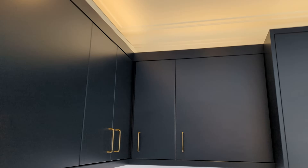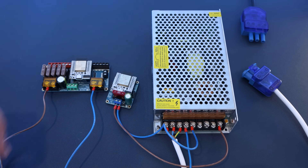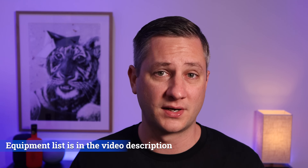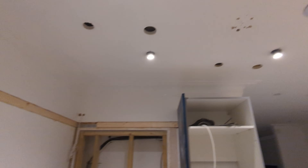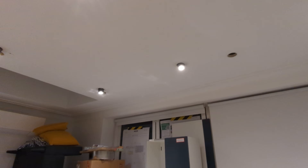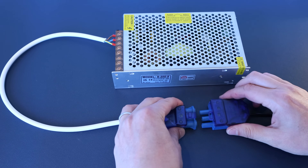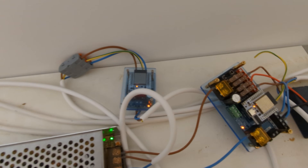In addition to the LED strips and controller boards, I needed a 5V power supply capable of powering these LEDs at a decent brightness level. The power supply was going to be placed on top of the cabinets, out of reach. This meant I was able to use a cage-style power supply, which is a little gnarly as it has exposed 220V terminals. The power supply has short circuit protection, over voltage protection, and my house is protected by circuit breakers and RCDs. When the kitchen was installed, I had my electrician wire 220V supply cables to the tops and underneath all of the kitchen cabinets, with some underneath the island too, just in case. The cables have blue connectors on the end — a safe way for me to connect and disconnect the power supplies.